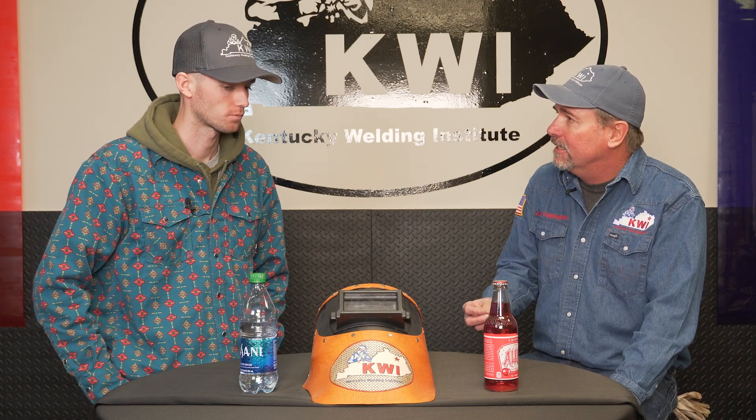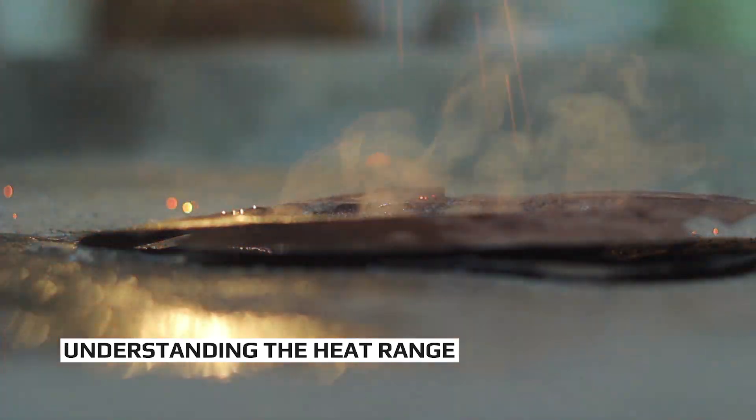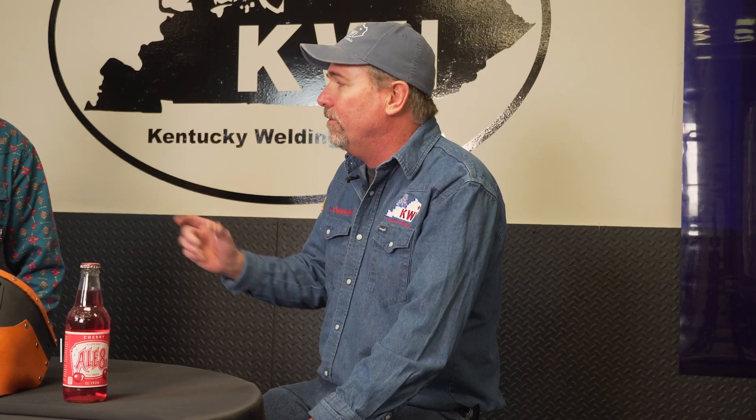Within the process, there are a few variables. If I'm stick welding, I don't need shielding gas, but if I'm doing TIG, GMAW, or FCAW, I need gas. The heat range is also important — the procedure will tell you a range to set your machine in for that sweet spot. If you go above that range, you're going to damage the base metal, because it's rated for a certain temperature and cool-down time. Staying within the weld procedure temperature is very important, and you also need to watch your base metal temperature.